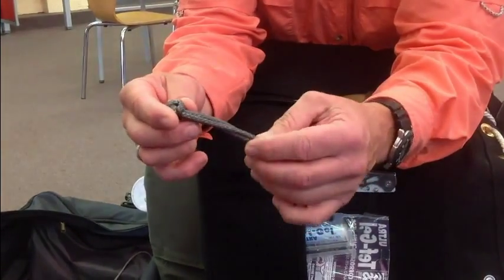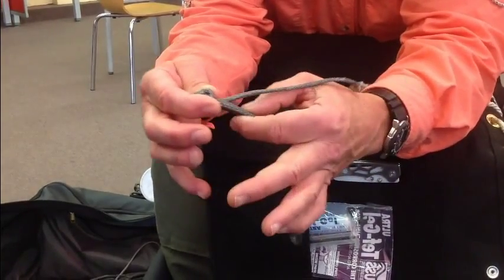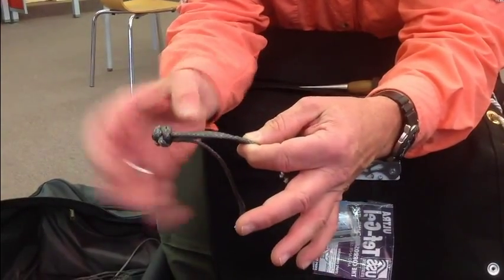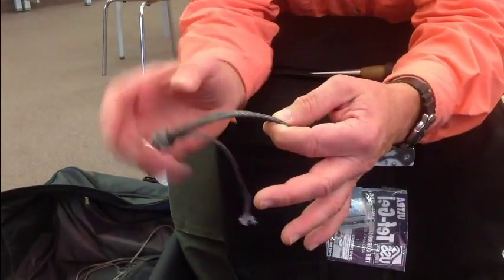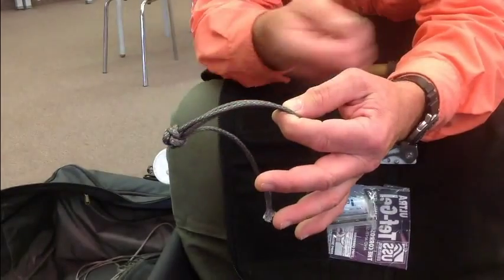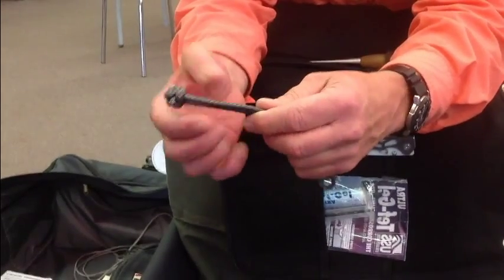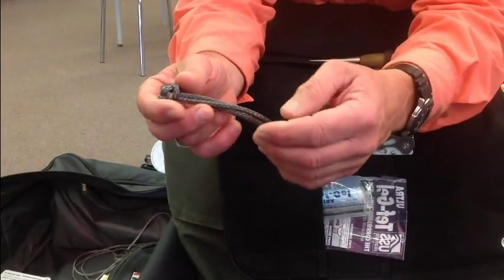So all I'm going to do, or would do in the real world, is bury these ends into the standing parts at least 10 diameters down, like about that far. This stuff will shrink up, so I might put the tool in a little further down and then it'll shrink up to about 10 diameters. So you just, with a wand, reach in there and grab it and pull the end down. And do that with both of them, and cut the ends on a taper, on an angle, with a ceramic knife. You want to cut them with a ceramic knife, otherwise you'll just dull your steel knife.